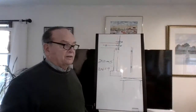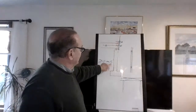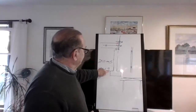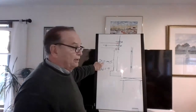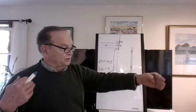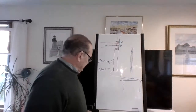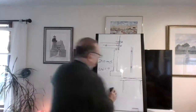And I looked in the charts, and they were right. It's within a few inches. Technically, this is not exactly right, but it's within a few inches one way or the other. Again, not our trade, but you've got a span that's reaching the maximum for a 2x10. 15 feet would be a house where from the foundation to the center beam is 15 feet. That's maxed out. It's got no extra there to play with. You don't want to start drilling any more holes in that than you have to.